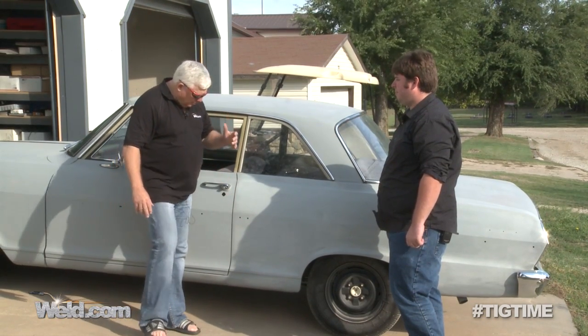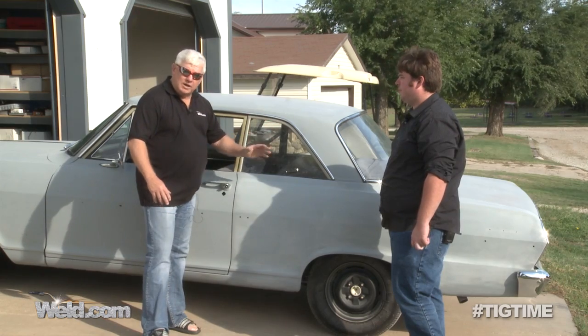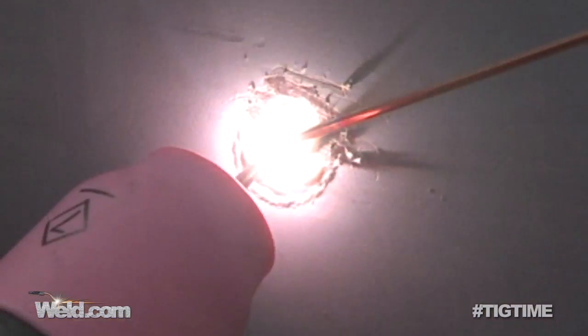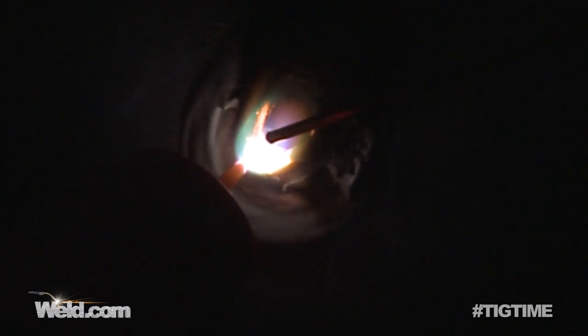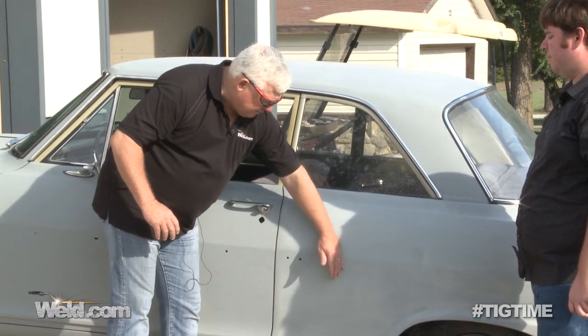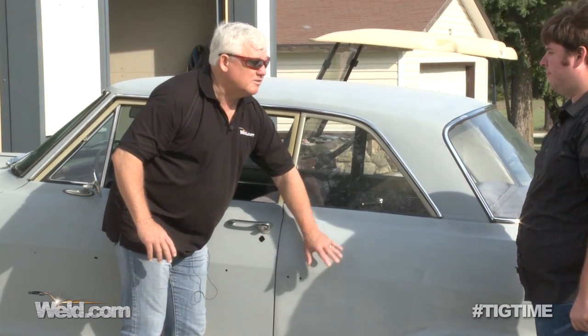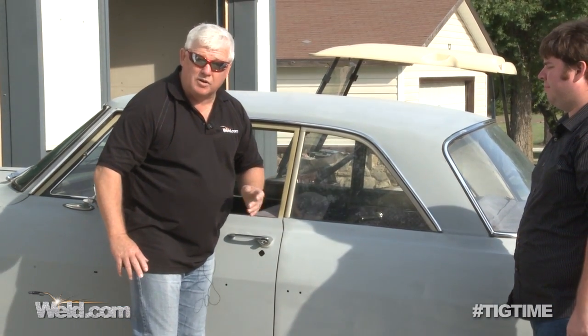What I'm going to attempt here today is to fill all the holes on both sides. You'll see that I'm going to TIG weld it, going in a circular motion and adding filler to it. Now, there's going to be a little bit of shrinkage — we have very good controlled shrinkage with the TIG process. When I finish, he's going to have to polish it down, get it nice and smooth, and then put a little skim layer of bondo to make sure you can't see the shrinkage marks.